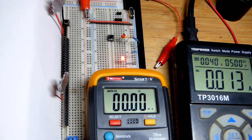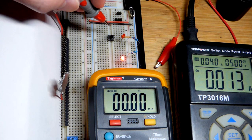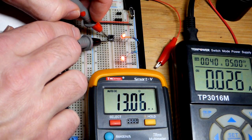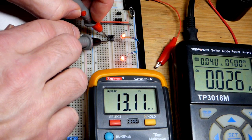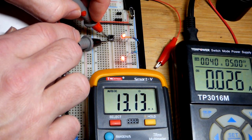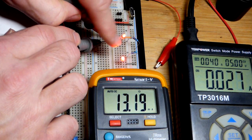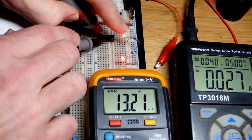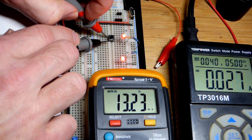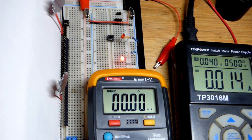Now we have the open switch up there, I mean, there's a gap. And so we're going to close the circuit through the meter. And so that's another way you can take a current measurement. It may go down a little bit because we got some resistance where there's connections and stuff, and also resistors aren't perfect values, and LEDs may not drop the same amount of voltage perfectly, usually pretty close. But in any case, that's one way you can take a current measurement, just by bridging the gap.